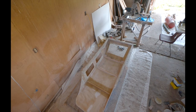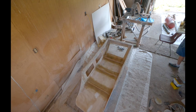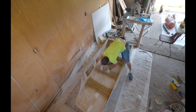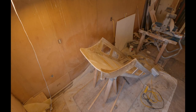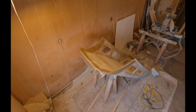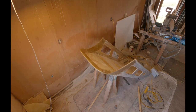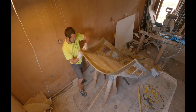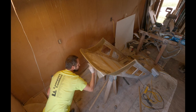In this shot I am adding three layers of glass to the cross members on the roof of the Dodger. They happened to be the only pieces of wood on the Dodger and allowed me to use barrel nuts to secure the tracks for the companionway hatches. I typically tried to do three layers of tabbing at a time — chop strand, woven, and then another layer of chop strand — pre-cutting the corners for any of my radiuses, and also pre-infusing the resin into the glass. This method often allowed me to get all of the air bubbles out and was much faster than sanding between individual layers of glass.